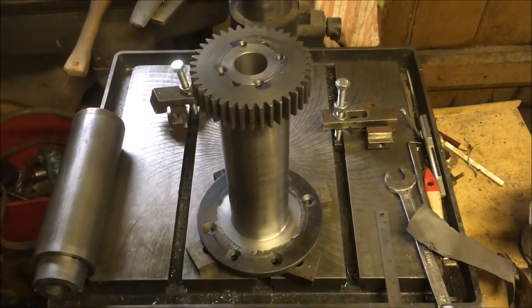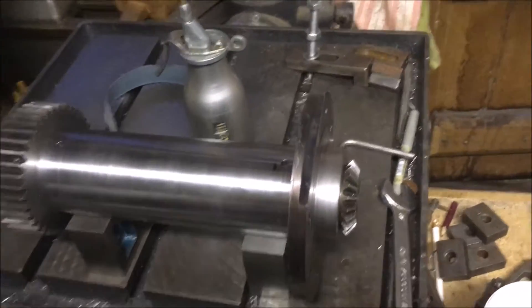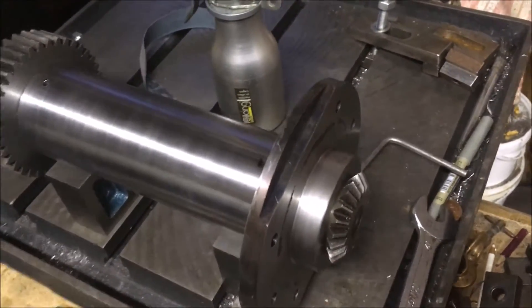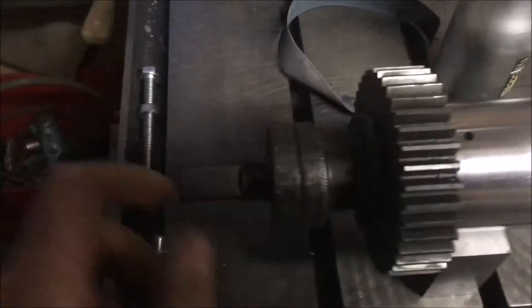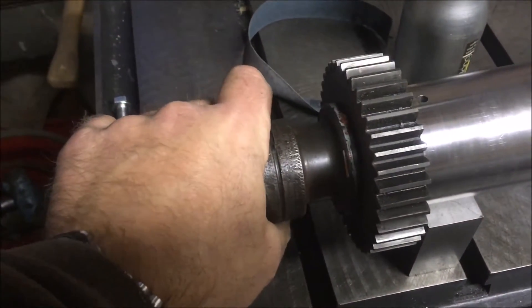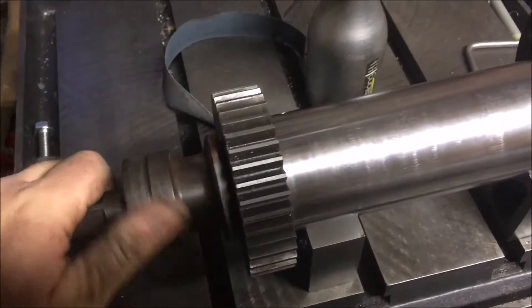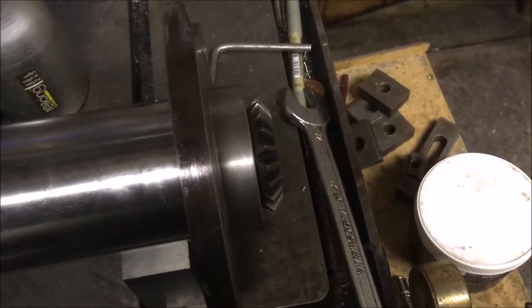I think I'm going to go in and have a cup of tea and a couple of paracetamol. So that's the central shaft fitted — the ball gear fits against here and then contacts the other bevel gear, and on this end the drive. That's the locking collar — once the stroke's adjusted, I'll just grab the shaft, loosen that off — it turns nice and freely — and then locks up.